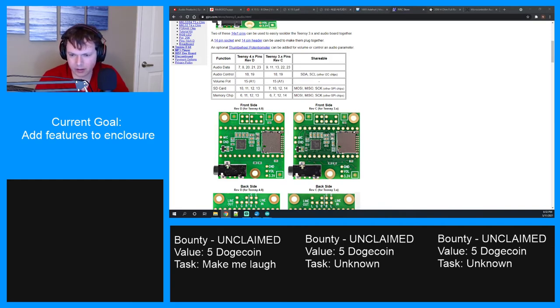Okay, I think we can make that work then. Use diode protection and drive a transistor. That makes the most sense, honestly. All right, just reading through a forum. So it looks like we can connect the speaker directly, but we need to drive it through a MOSFET at least or something. And I would like to see if getting an amplifier, like this one chip that I think I looked up, might pull this off.